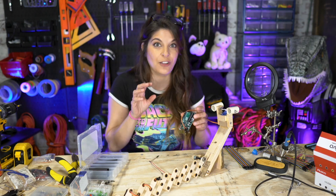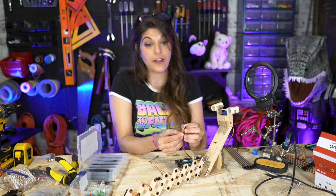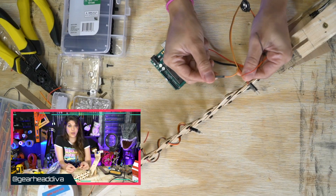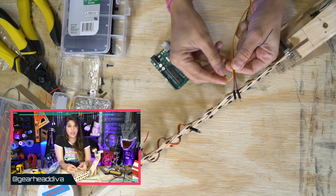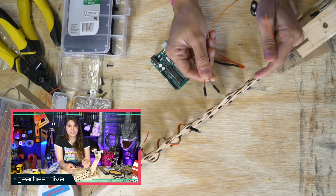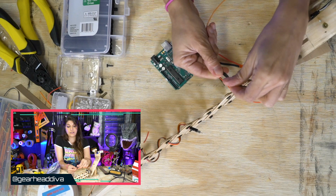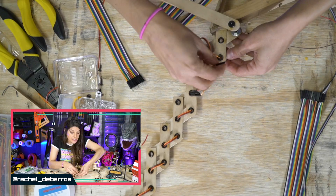Like: if it's yellow, what do I do? If it's red, what do I do? But the power and the ground for the servo are actually going to get wired to a totally separate battery. So the signal wire goes into the Arduino, while the power and ground get chopped and matched up — red to red and black to black, or brown to black in this case — and that'll hook up to the battery.